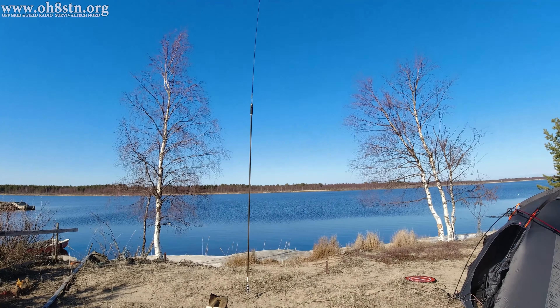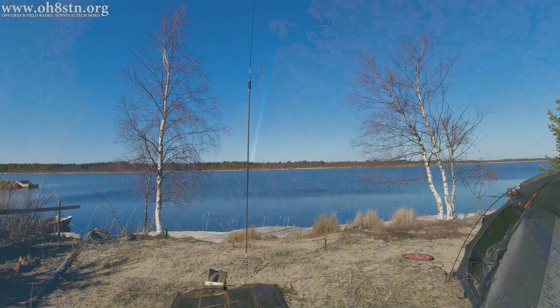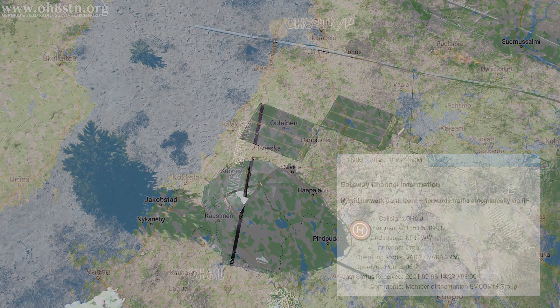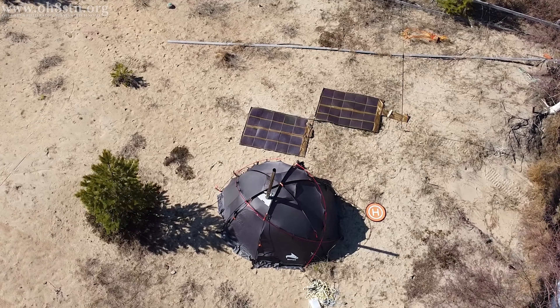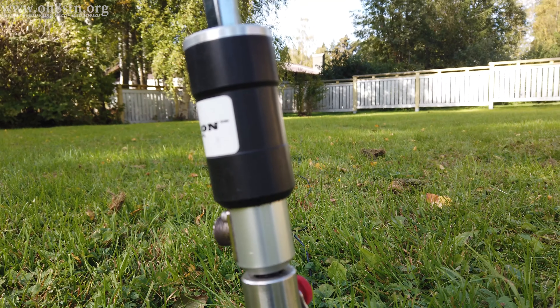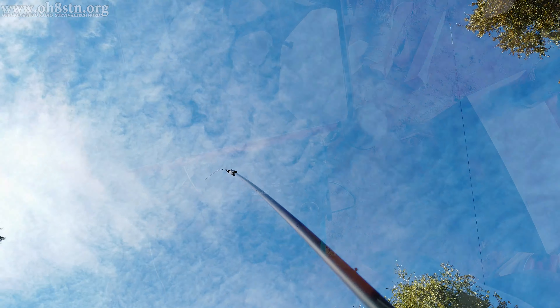This brings me to the last reason I love these broadband antennas. I'm not trying to win a contest — I'm trying to initiate regional communications without actually knowing which of those tactical bands are going to be accessible to me. A broadband antenna sacrifices a bit of efficiency in exchange for convenience. Certainly, if I were trying to win a contest on the lower bands and could choose the band I wanted, I would probably choose a resonant antenna. For emergency communications and preparedness, the broadband antenna is just fine.